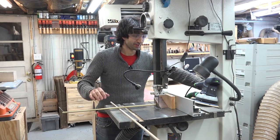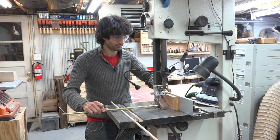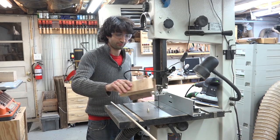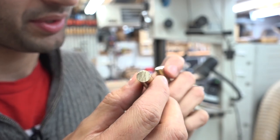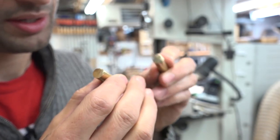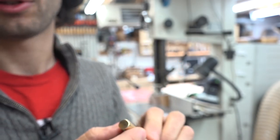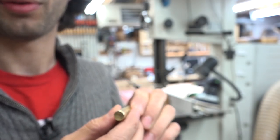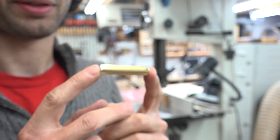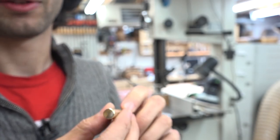I just have a stick here to level things out. So that's the one I just cut, and this one I polished up a little bit just to clean things up. There are still some scratches in there but I'm not too worried about it — it's pretty clean from the get-go. This chamfer or round-over serves a dual purpose: it makes it easier to go into the hole and through the tenon, and if the pin isn't exactly the right length — too short or too long — this beveled area will kind of hide that and hide the fact that it's not flush.